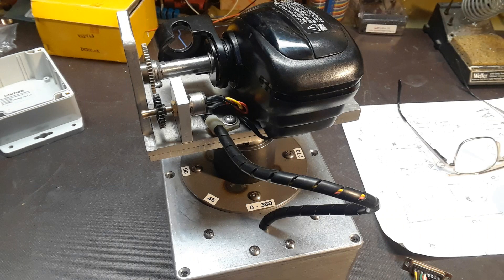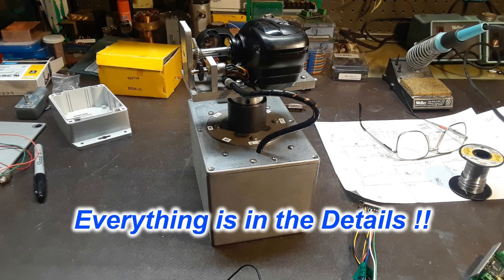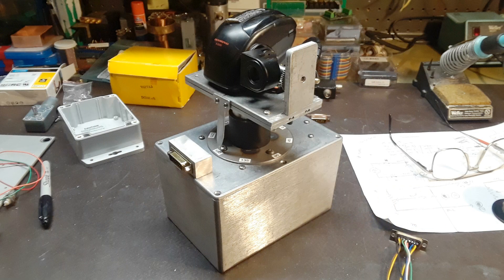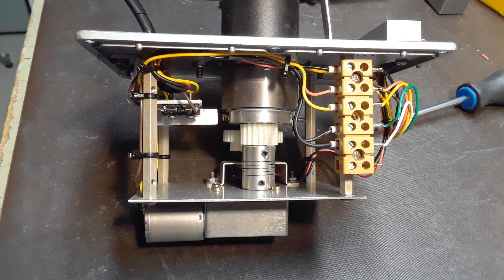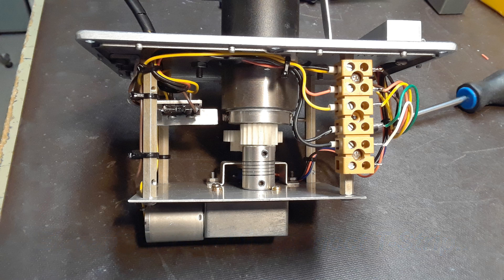On the opposite side, I've got the potentiometer wired up to the harness that goes into the box. Got some twisty wire wrap on there to keep things together, and it fell together quite well. It does a nice rotation without getting things tangled up. The top elevation assembly will unscrew on one plate, completely lift off, and if you need to take it completely off to work on something, the wiring goes down inside this terminal strip. You simply undo it all and it'll completely separate from the main body.